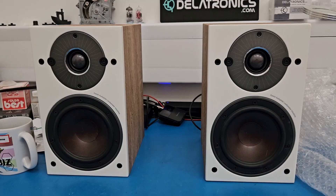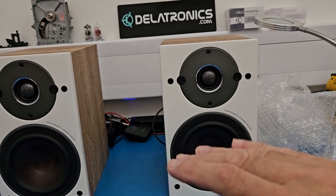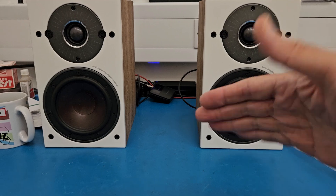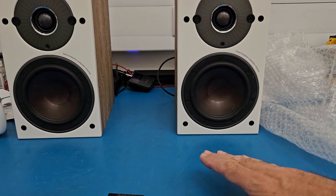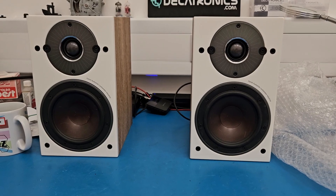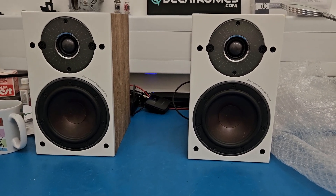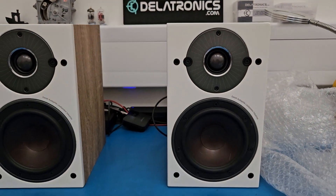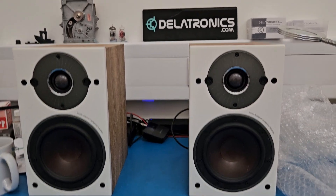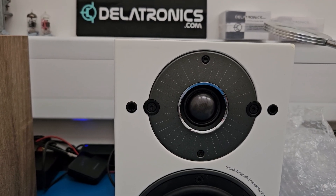What I'm thinking of doing in the future is making a baffle for the back, printing a plastic cover where the speaker terminals are with a little hole so the wires can come out, then having the crossover and terminals outside the speaker so I can fiddle with the values. I'm thinking of putting a very low-resistance pot in place of one of the resistors that alters the tweeter sensitivity. I want to try a variable capacitor too, but you have to be careful because if you put too low a frequency through the tweeters you can easily burn out the voice coil.